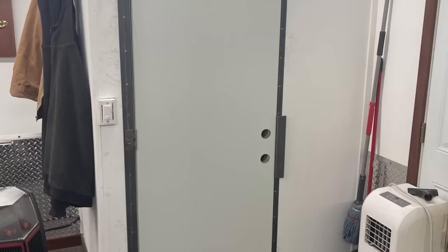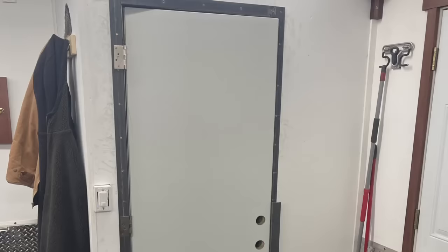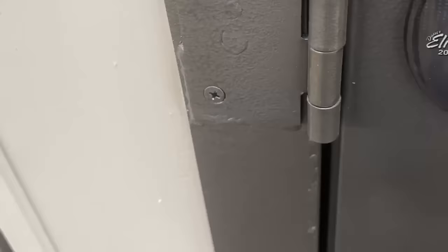Now it's time to frame in the door. There's my 30-inch steel door — that's a heavy-duty steel door, basically the same kind you would find in an old-style school or an industrial setting. Very heavy gauge, very heavy-duty. I framed it using 3/16ths flat steel, and then I welded it all together inside of the frame as well as screwing it in with 3-inch construction screws. The 3-inch construction screws are screwed in from both the exterior and the interior — just taking the screws out from the outside is not going to allow anybody to remove that door. It is all welded into place.